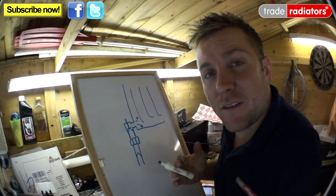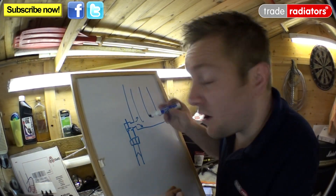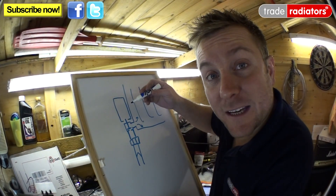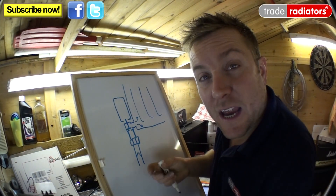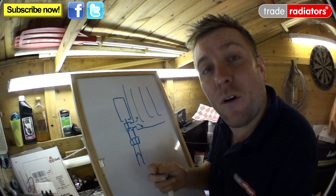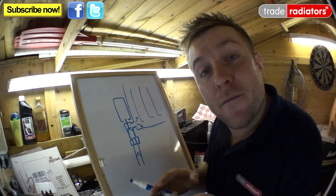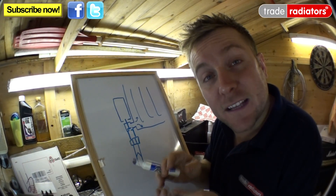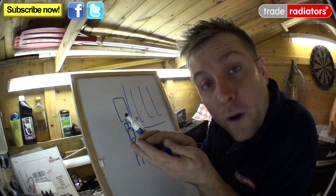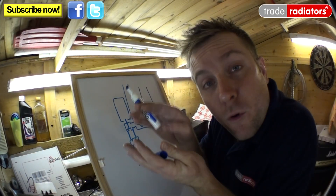So how does a thermostatic radiator valve actually automatically adjust where that pin is? It's very easy. On top of this you'll have the thermostatic part of the radiator — the plastic bit that you twist that has numbers on the sides correlating to how hot you want the room to be. Usually they have a very responsive metal that, as it gets hot and cold, will expand and contract. The hotter something is, the more it expands, and the colder it is, the more it will contract.